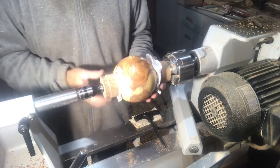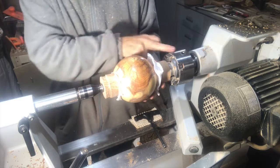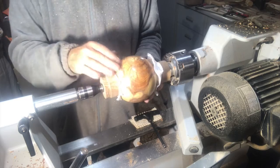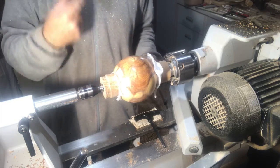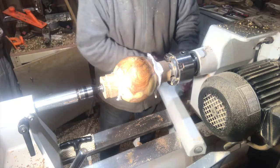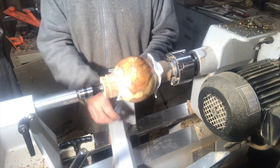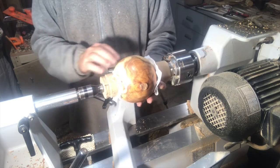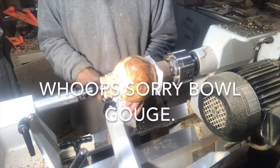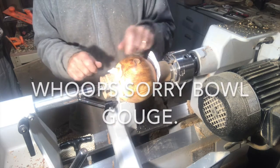Right, all I've done, I've got two rounded off pieces of wood which fit into the chuck, and they're shaped inside the same diameter as that. Now Paul, or should I say Paul Howard because I don't know him, in his video he says that what you should do is get that central, and then you can get that in your chuck, and all you do is take it off with a skew chisel.